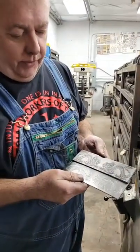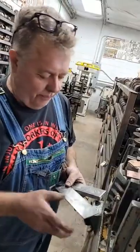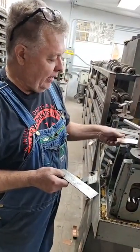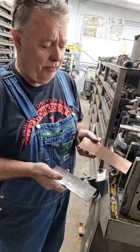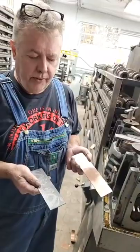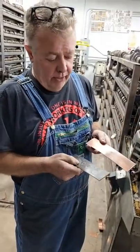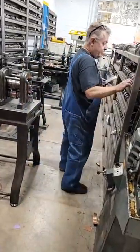We make our dies so that they're designed to be used. Everybody's dies are different. Some people want to use foam and they tell you, you need to have manila folders and paper all over them. We don't do that. My directions are different than theirs — they're not doing anything wrong, they're just doing it differently. Every die that I create is designed. I like to use 16 gauge metal because by the time I roll this through, it's going to be probably 20 gauge by the time it gets through this rolling mill. So if someone says they like to use 26 gauge — that's impossible for our dies. If you want to use 26 gauge, do not buy my dies at all. Please don't buy them. They're not going to work for you. They're designed to leave a flat back. The reason we do it this way is because that is how dies have always been made.